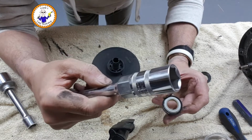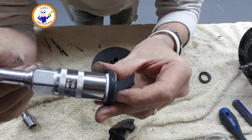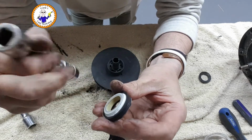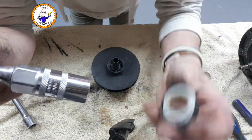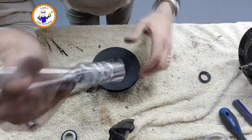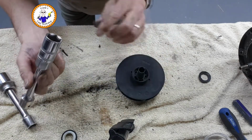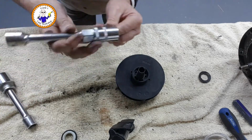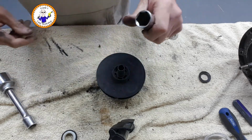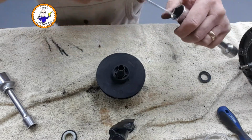Spark plug socket. Okay, this spark plug socket fits on the face of the seal. Now I've got to make sure after I've pressed it in that this face is clean again. Okay, so this is the old seal, so just try it on there. That fits lovely. Right, and also there's enough clearance depth wise to go over the shaft. Just make sure. Let's just take that rubber seal out of there just to give us a fighting chance. This obviously because it's a spark plug socket.